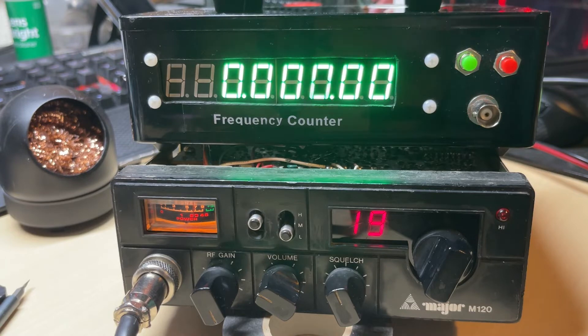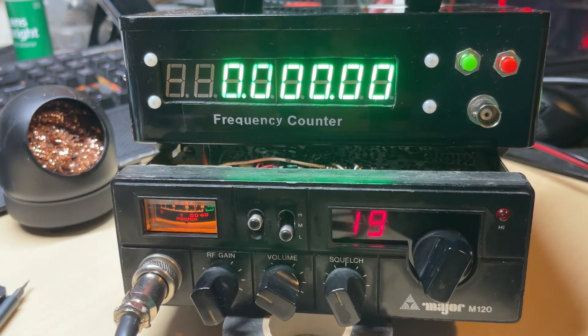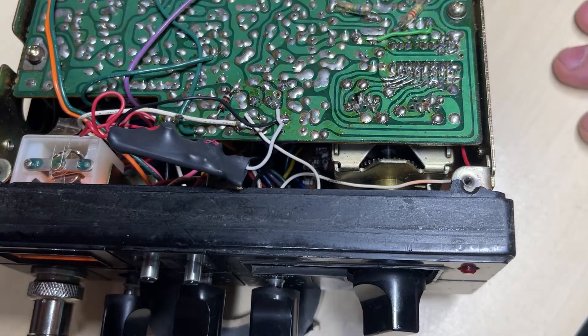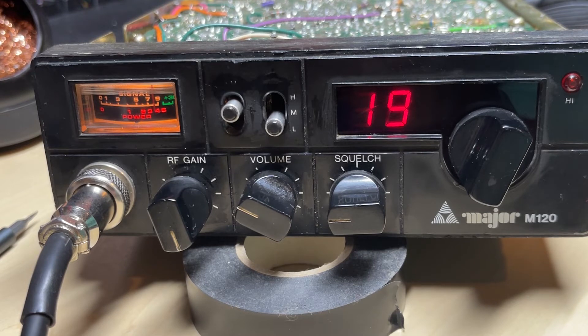So that gives us a full 40-channel readout on this. That was easy enough to do — and as you can see there's the frequency compensation board. It just takes a little bit of work to get that working, but once it's in and working everything's perfect. On a radio that hasn't been molested, there's no need for any cut tracks. You just need to find yourself a switch and use it if you have got a KC shift frequency compensation board. Anyway, thanks for watching, see you in the next episode.